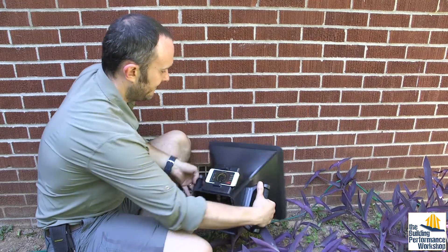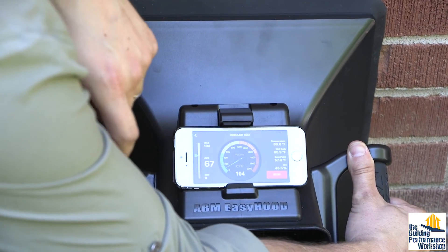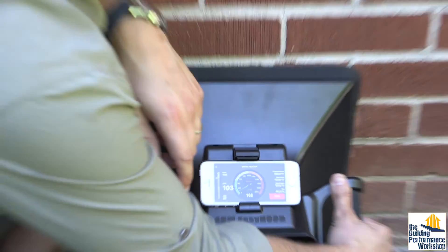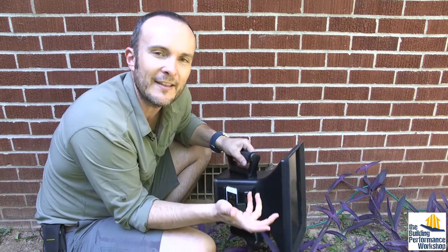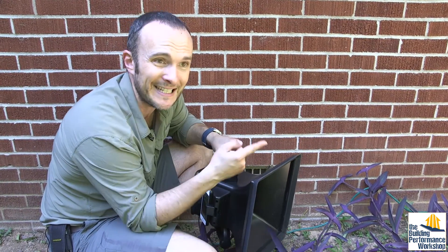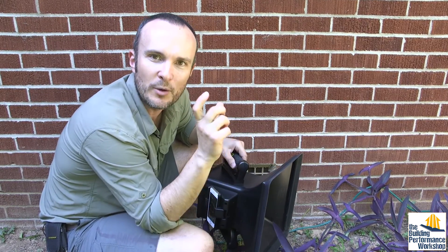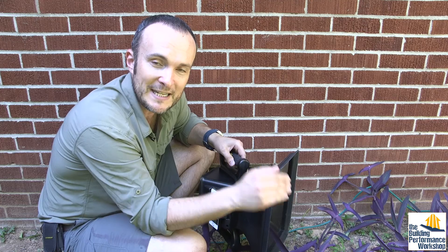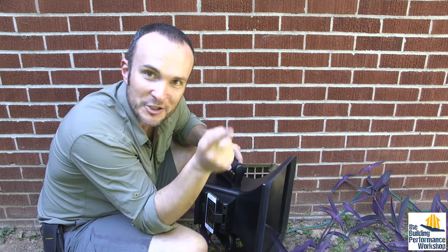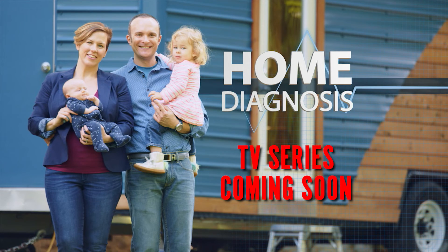Crawl space vent — flow hood. I can see over 100 CFM going through this one vent right now. There are 11 of these. 100 CFM times 11 is 1,100 CFM — a lot that's adding to the blower door number. That's how you can start thinking creatively about taking your performance contracting to the next level. Next episode in this series is going to address this crawl space — the first important place to work in summertime. Make sure you subscribe, comment, and participate. See you next time.